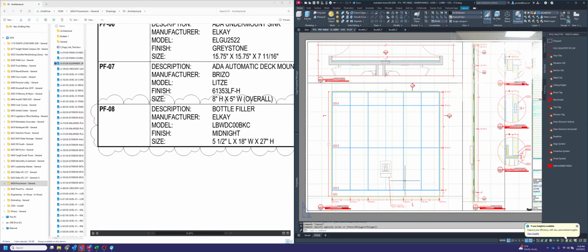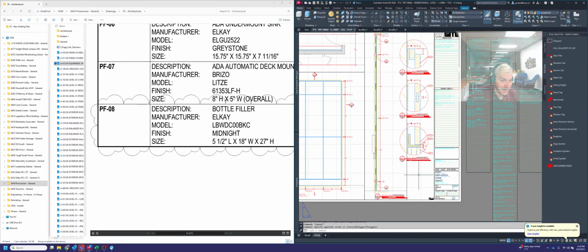Now, if you keep drawing the way that I've taught you, where you're using construction lines to match your plan view up to your elevation view and your elevation view up to your section view, it should alleviate any concern about not having views that line up. But if you start to draw things individually and don't use those construction lines, then you might run into some issues where things may not line up exactly right. Because we used the construction line approach to drawing these, I'm fairly certain that everything is where it needs to be. So really not a lot of issues there.